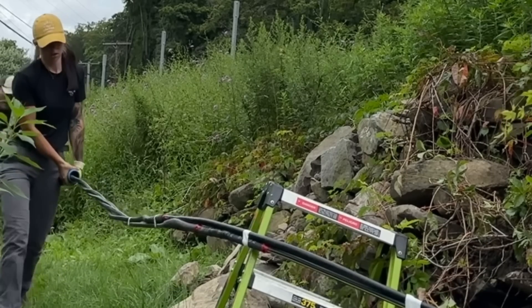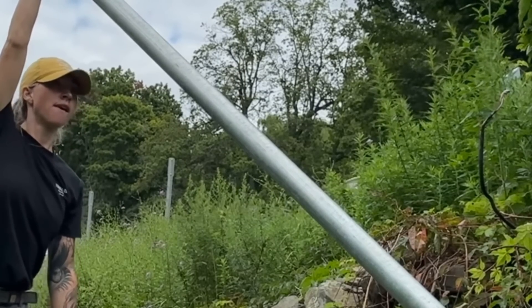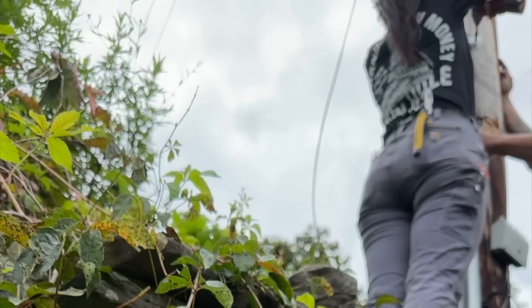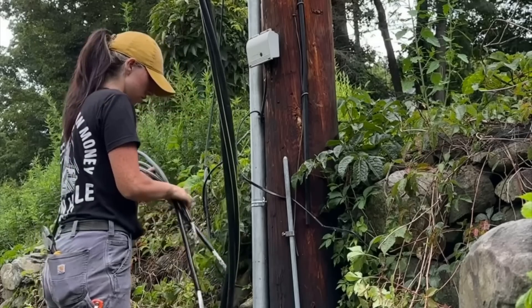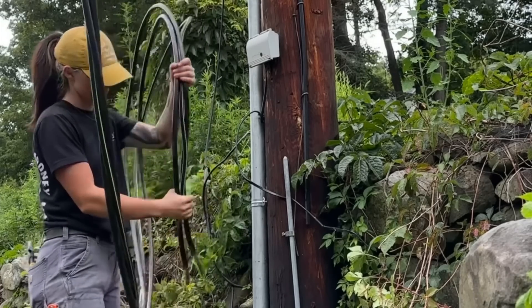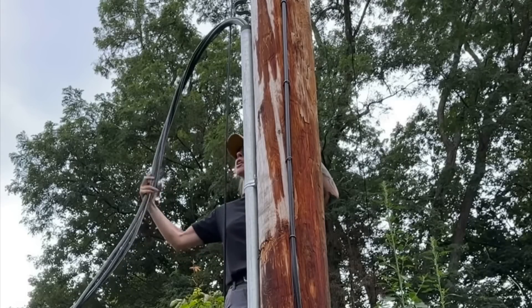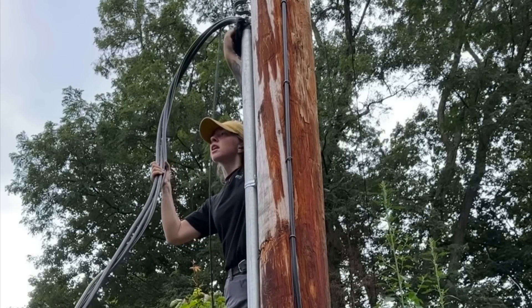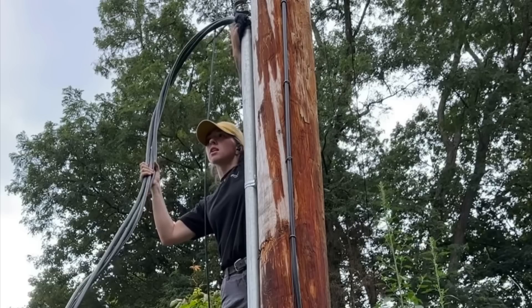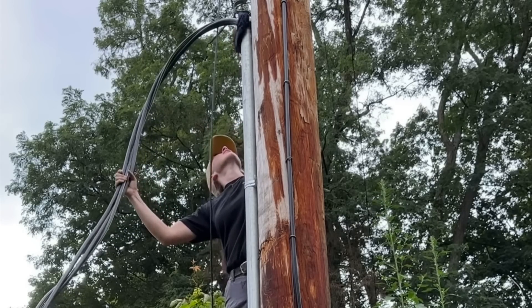Then I just put my rigid on and brought it back up the pole — the hardest part, but it really wasn't that bad. This whole job took me about an hour to an hour and a half. I had a guy help me get the service mast up, then I coiled my wire, called the utility company, and told them she's ready to hook up. I also put something there so the wire didn't nick at the top piece of rigid, since the utility company will put one or two pieces of PVC on top — that's their responsibility.